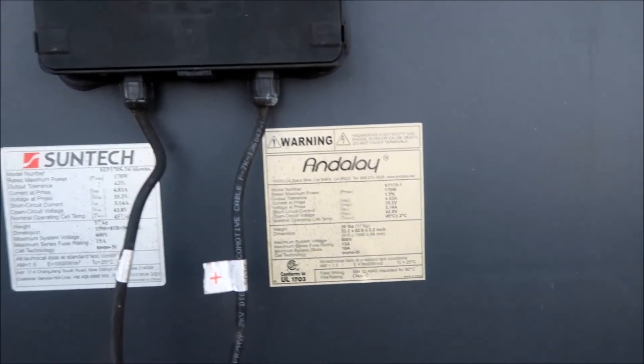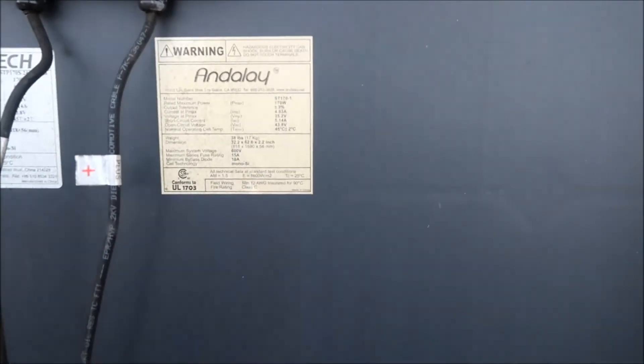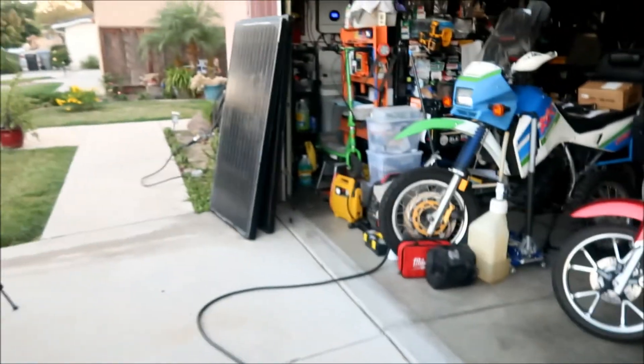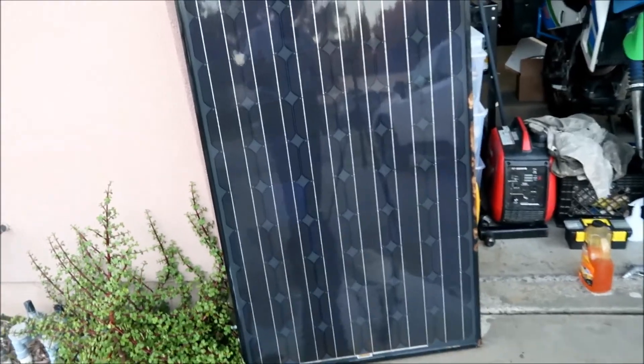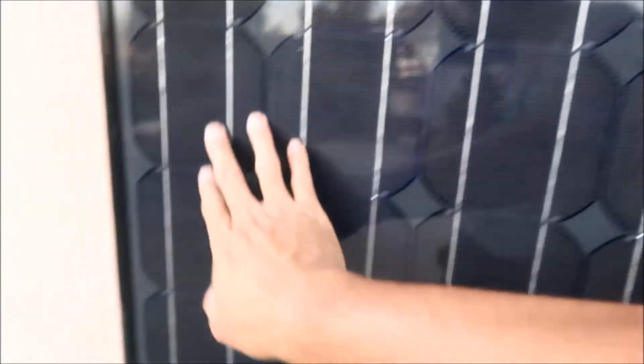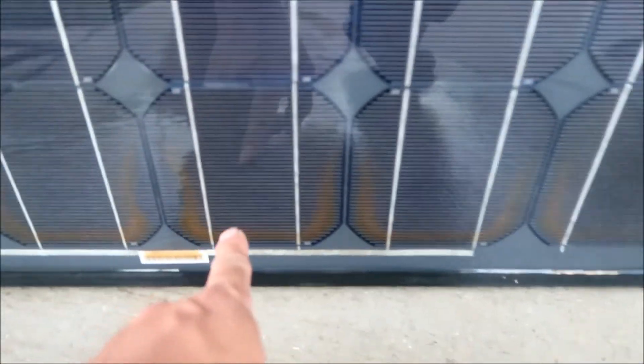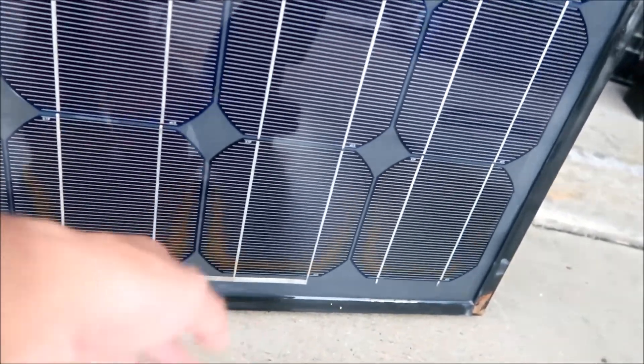The label shows American spec - 12 gauge wire, fire class rating C. I used a compressor to blow off the dirt and then rinsed and scrubbed the panels with soap and water. The glass still feels okay. Some of the cells are a different color - looks like some kind of rust or discoloration in there. One cell looks cracked. For 10-year-old used panels though, it doesn't look too bad overall. We'll see how good they perform.